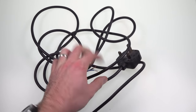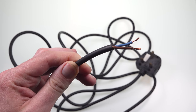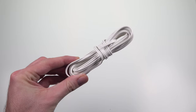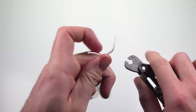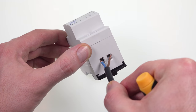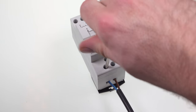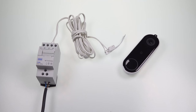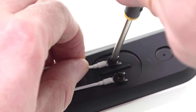To test it out and make sure it all worked, I took an old power cable from my box of spares — a two-core cable is all that's needed as there's no earth connection going to the transformer. If they're not already exposed, use a wire stripper to strip and twist a short length from each core, and then do the same with the length of bell cable on each end. You can pop the included cable clips onto the cable if you like, although they're not required, and then connect the mains cable into the bottom of the transformer, making sure the wires are fully in with no exposed copper visible, and connect the bell wire into the top of the transformer at the 0 and 24 volt contacts. Then connect the other end of the bell wire to the device itself — the connections aren't polarised so it makes no difference which you connect to which.